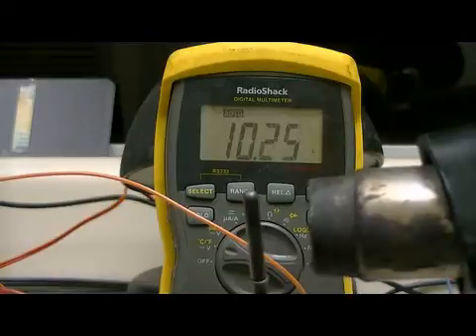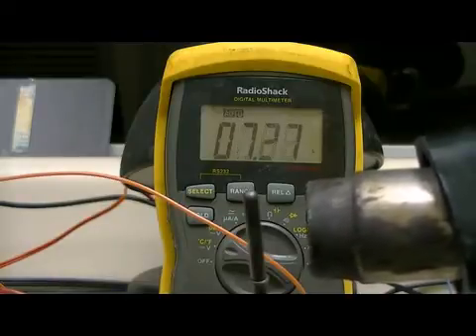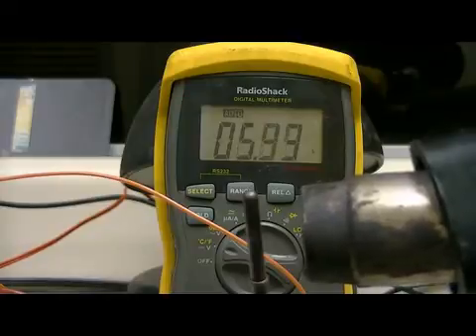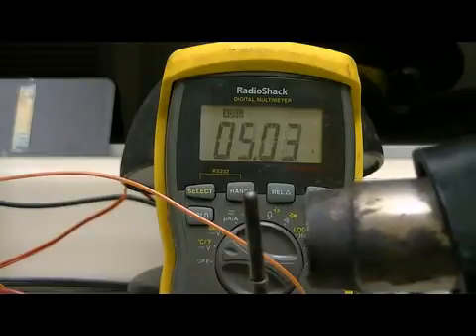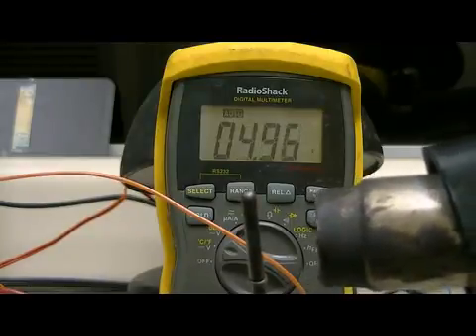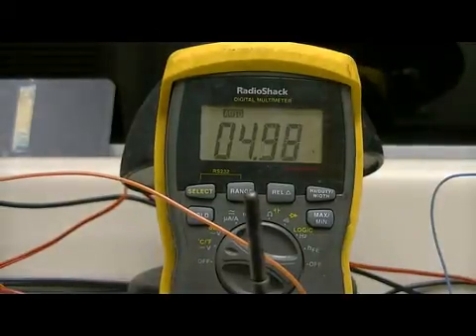When it's at the highest voltage that I want, I will adjust it down to five and it won't exceed five. Close enough. Now we'll take away the paint stripper gun — wait a couple of minutes and you'll see the voltage start to drop as the thermocouple cools off. It's still conducting a little heat. This is where you might want to adjust it back just a tad — there you go. Now the temperature on the thermocouple is beginning to drop.